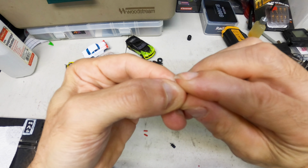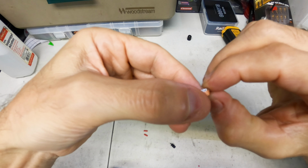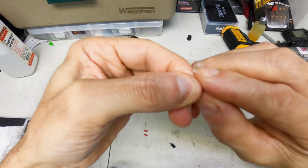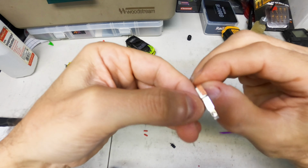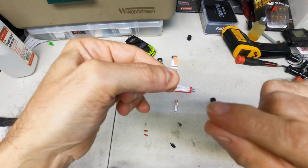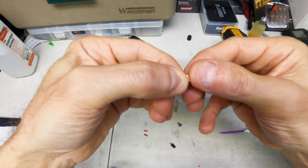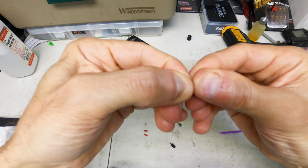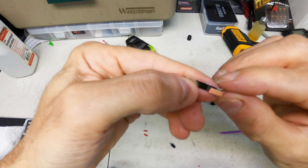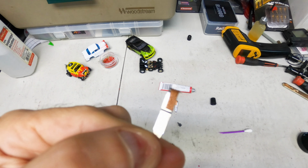And I found the electric goes right through this. I actually ran a big RC car motor through a shoe, through the positive wire, by lifting up one end of this shoe and going through the other end from the braid. And I ran a big RC motor that draws like 20 amps, 15 continuous, and it worked perfect. It didn't get hot or nothing. Just push that down, and that's number 2.